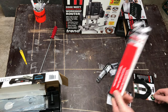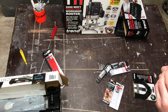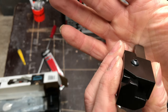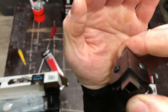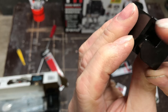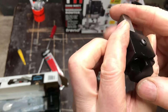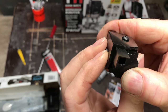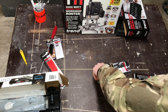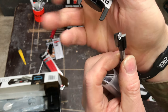Pack of pencils — you know what to do with those. Now this corner chisel is quite clever — something I wish I'd had a few years ago. When you rout a hinge out, because the bit is round you get a radius corner. With this tool, you move it up to the corner — there's a cutter that matches the radius — and whack it on top with a hammer. Basically it's a square chisel and it'll cut that radius corner out so you end up with nice square hinges. You could do it manually with a chisel, but one blow of the hammer and it's done.